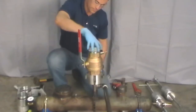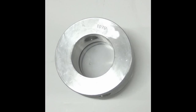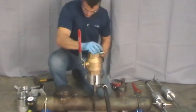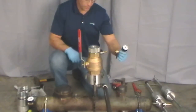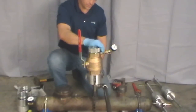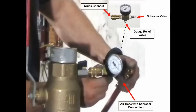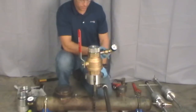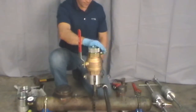Fit and tighten the viewport onto the ball valve and pressure test the entire assembly to mains operating pressure. To pressure test, push on the pressure test assembly and open the chrome plated ball valve. Introduce air through the Schrader valve and test to mains operating pressure. Make sure the gauge relief valve is fully closed. When the pressure test is complete, open the gauge relief valve to release the air and remove the pressure test assembly.